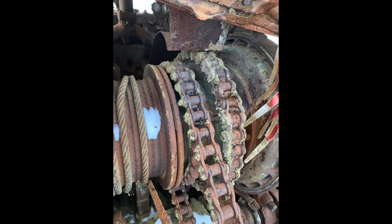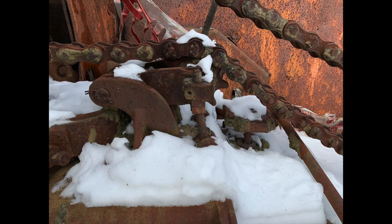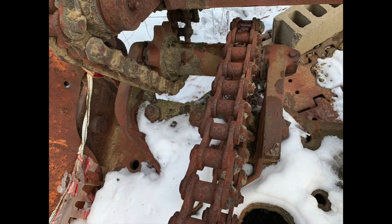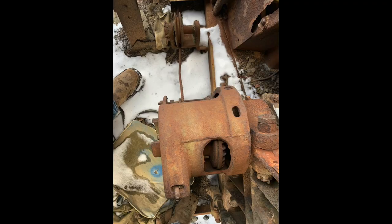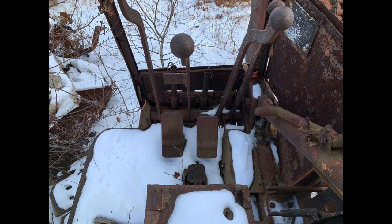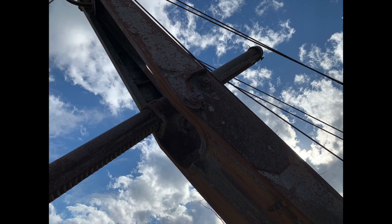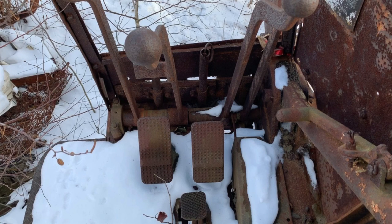There are lots of jack shafts and chains to run this machine. You can see how there are some adjustments on the chains here. Another jack shaft and then the chain runs up the boom. That's the trip for the bucket. See the little piece of angle iron there on the crowd lever. There's the serial number. You can see the tubular dipper with the rack on it. Piece of angle iron there on the crowd lever gives you a little more leverage.